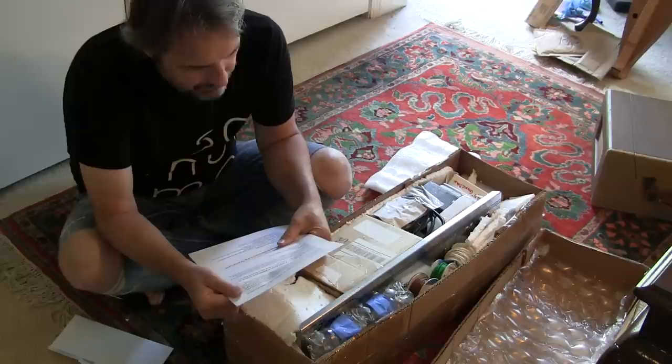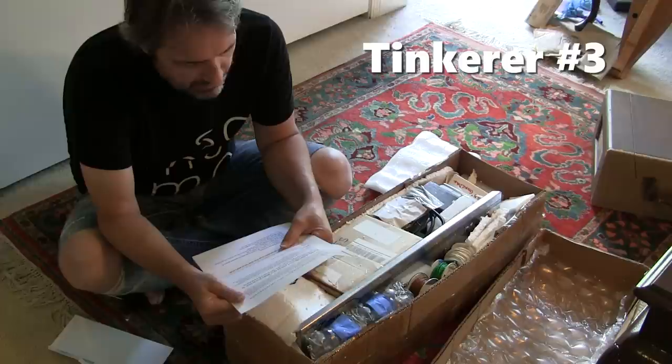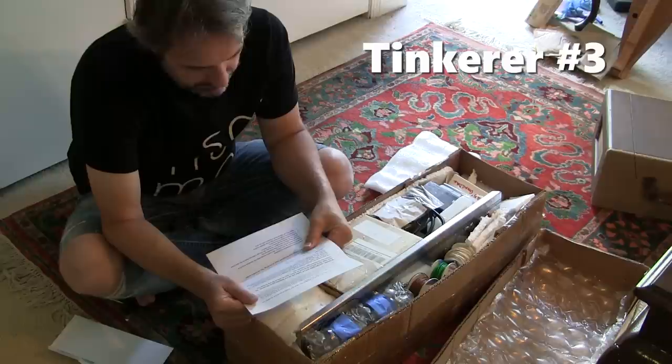The amp worked for a few months, and then after not playing it for several more months, it powered up and did not have sound. So I did some resistance testing on the output transformer. The reading seemed odd, so I swapped it out for a known good output transformer, and it did not resolve the no sound situation. That explains why the OT leads are clipped. So is the output transformer out of the amp now?